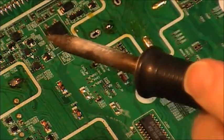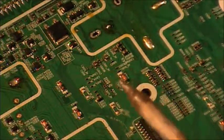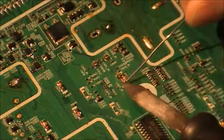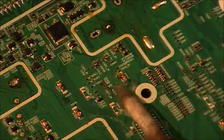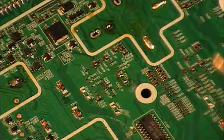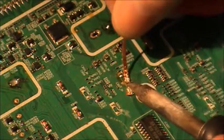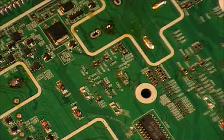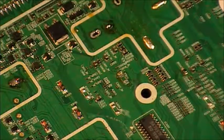Method one: I get my diode and solder on one side, then the other side, and just keep going like that and it comes off. Then clean up the board. It's simple, it's the quickest method.